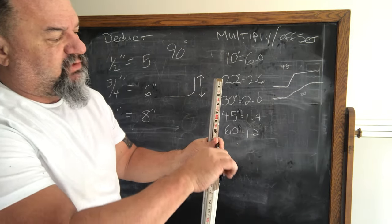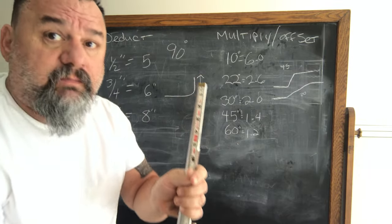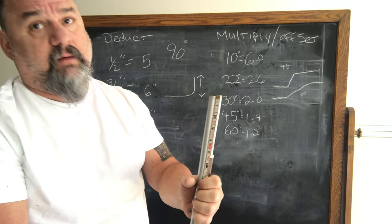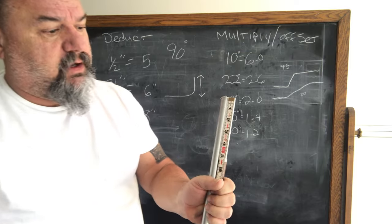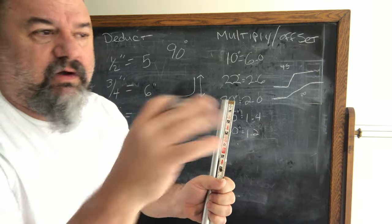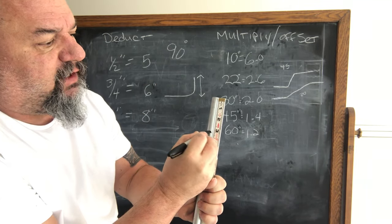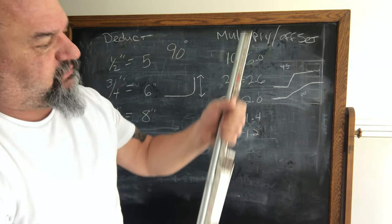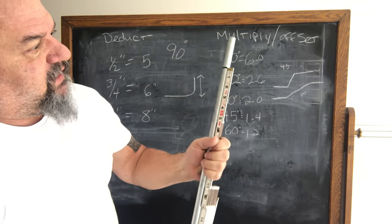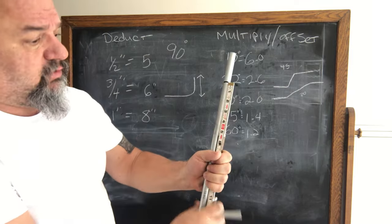I have my pipe and my marker — I usually use a pencil, but I'll use a marker so you can see it. My first mark: let's say I'm coming out and I want to offset into the wall — first mark at three inches. We want a six-inch offset, so six times two equals 12 inches — that's the distance to my second mark.